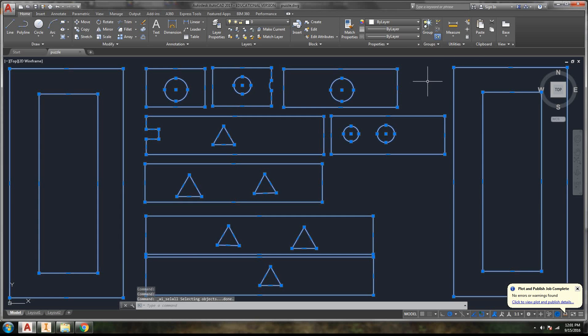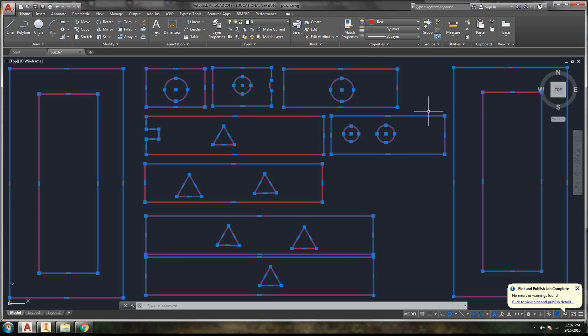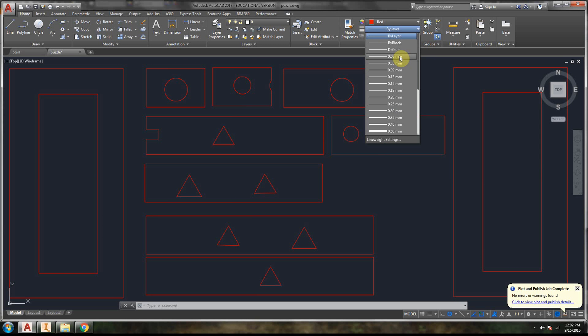The next thing: these lines are not going to work in the laser cutter as-is. In the laser cutter software I'm using — the VLS 6 — the laser is powered based upon the color of the line. We have to change the color to one that is vector-enabled. In my case it's red: red is 255, everything else is zero. Then I'm going to set the width of the lines to 0.0 millimeters.